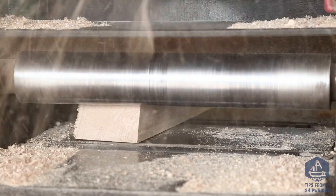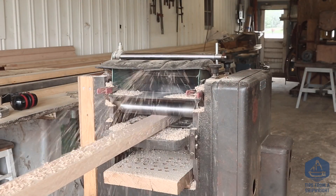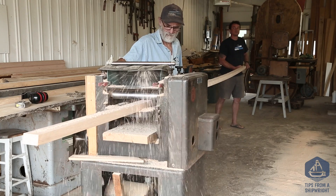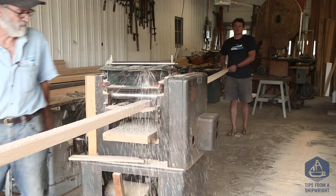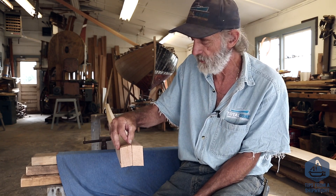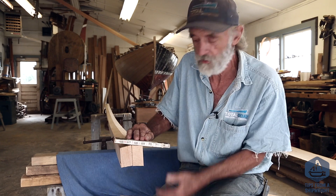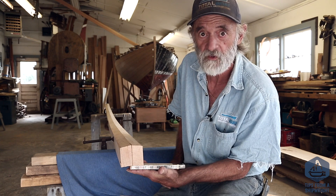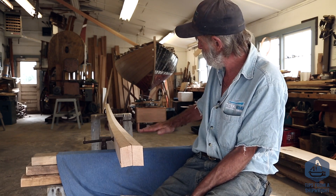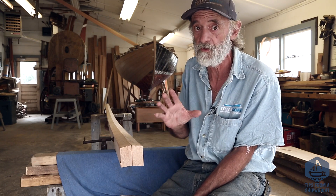You do have to get set up properly, and now that it's cut out, we're just going to pick them up and run them through a bench planer. We're going to plane it on both sides, take a few passes through there to get it to be parallel on both sides, and then we're going to measure the other chine log and make sure this one is exactly the same thickness. Now here are our completed chine logs. They're a mirror image of each other like I had said before. I ripped them both to two and a half inches tall and put them through the bench planer at an inch and a half. They've got a ten degree bevel ripped on the top just enough to stop the top of the chine log from collecting water, and a five degree bevel ripped on the bottom which is just about right for assembly so that I won't have to turn a lot of the chine log into dust while assembling the boat. They've got a curvature that matches the grain of the wood so that none of the grain is diagonally across the chine log, which could possibly make them break during assembly or sometime afterwards.